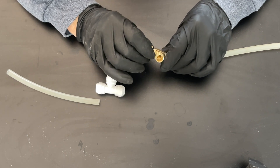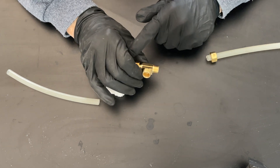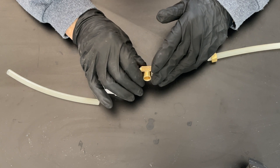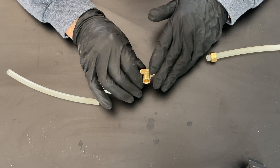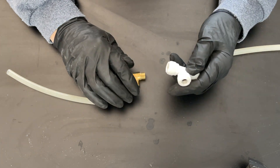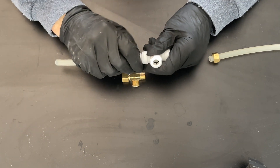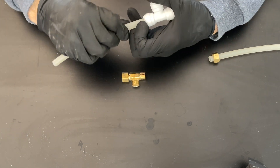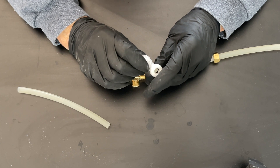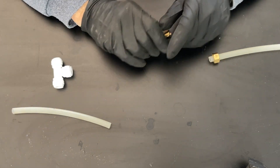This is a brass 3/8-inch T, different than the one I used in the video. I happened to have a reducing T with 3/8-inch compression fittings. You can buy those at hardware stores, building supply stores, or order them on Amazon. I also wanted to show this push-type fitting — this is a SharkBite. You just push the tube in and it locks. But I put all three sides in and it started leaking. I couldn't stop the leak and I couldn't get it out, so I had to cut it off and resort to my faithful brass fittings.